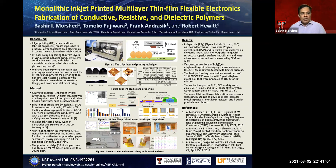We are using a Dimatix material deposition printer for this purpose, which has a 10 picoliter drop size, 16 nozzle array with 20 micrometer pitch. We are using silver nanoparticle ink, and we have achieved 25 milli-ohms per square surface resistivity on polyimide.